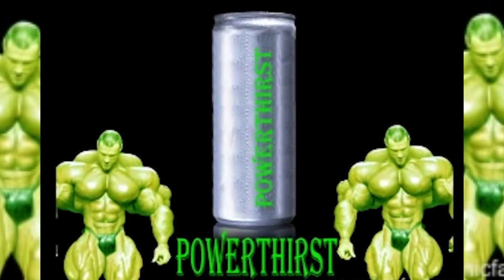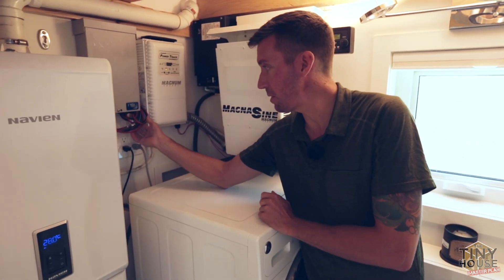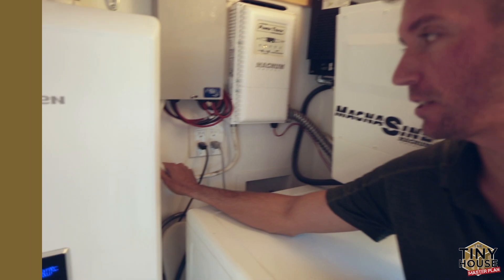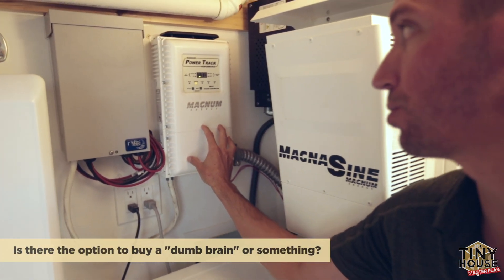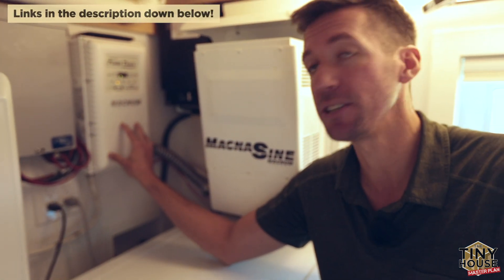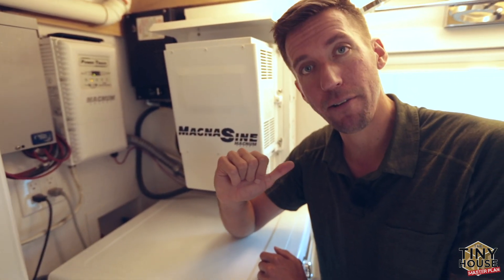Let's now dive deeper into the power systems. The 10 panels outside come in strings down to this combiner box — they come in from outside through the hole in the wall right here, and then they leave via one cord. That's what a combiner box does: it combines them into one cord so it can go to an intelligent brain called a charge controller. This charge controller monitors how that power is then put into the batteries.